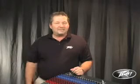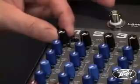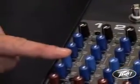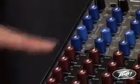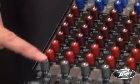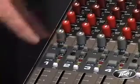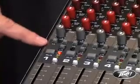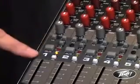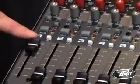Let me go through the basic analog features of these really fine four bus consoles. The microphone channels have an input gain and three band equalization with shiftable mids. Following the equalization section are six auxiliary sends, four pre and two post. Following the auxiliary buses is a pan pot and the associated assignment switches for the first, second, third, and fourth submixes, as well as straight to the left and right outputs. There's a mute, which mutes the entire strip including all the auxiliaries, and a pre-fade listen button. There are indicator lights for both the mute and the PFL, and beyond that is a high quality 60mm fader.